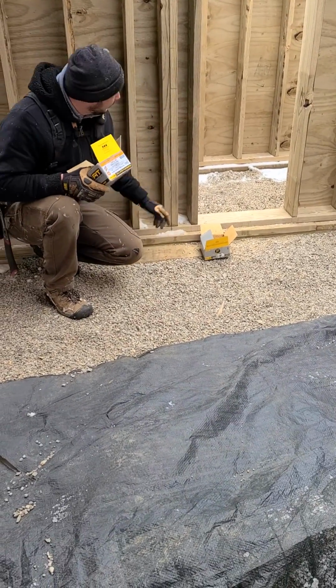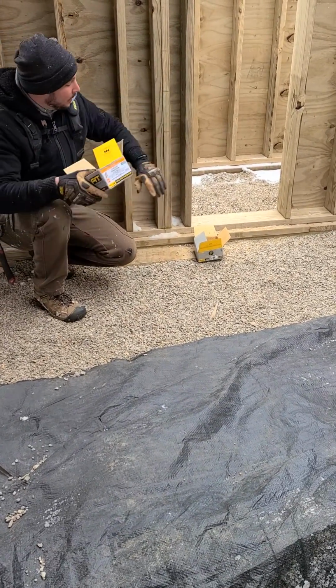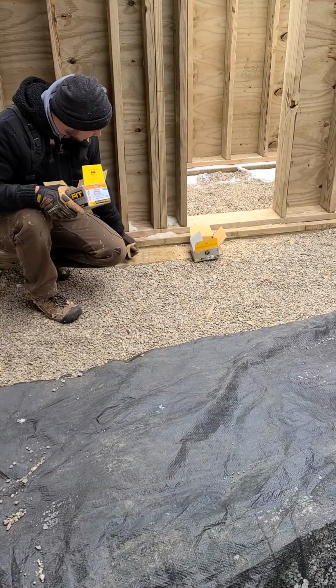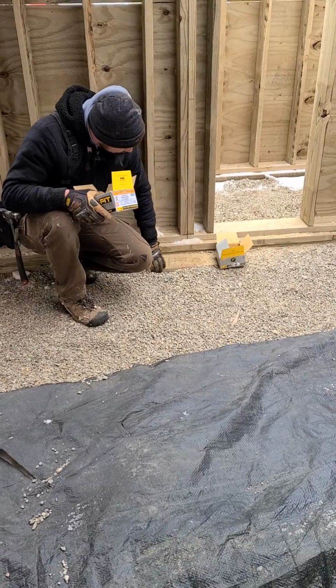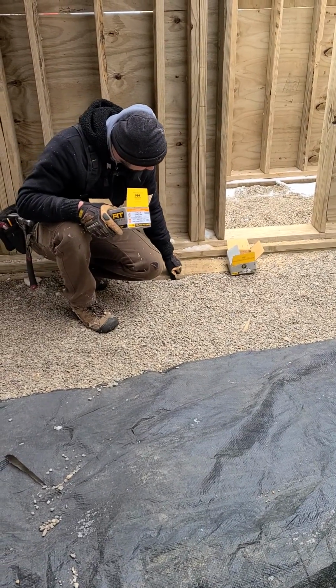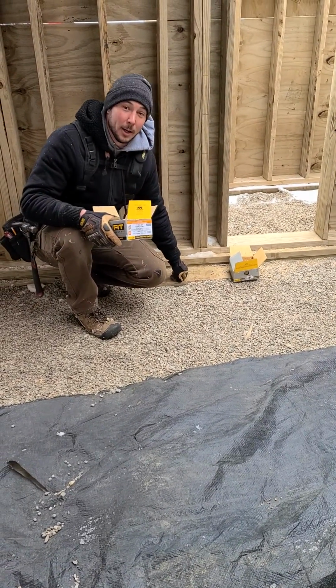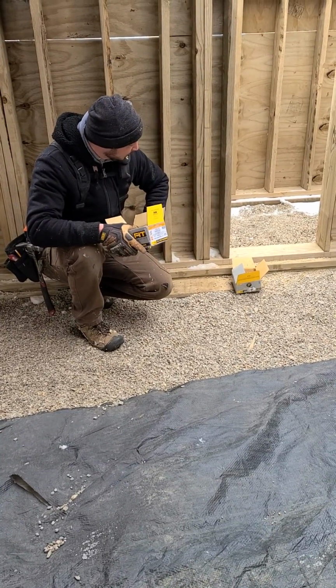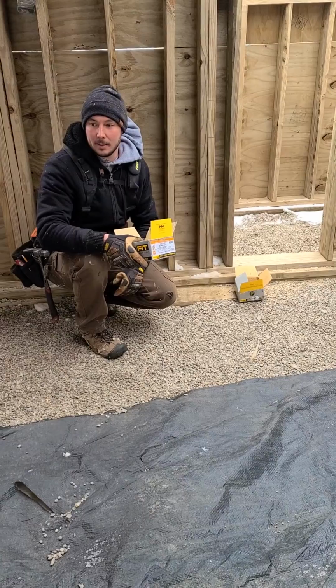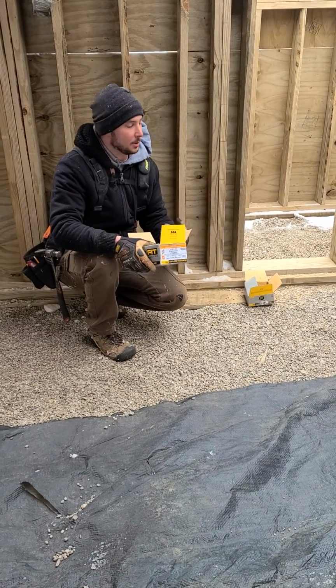And if you look down here, you can see this pad that we're sitting on. This is actually one of our point loads, running up from the house. It's typically about 4 to 5 pieces of permanent wood foundation plywood, layered and stacked, and these are all individually designed to meet the load specifications of the point load.